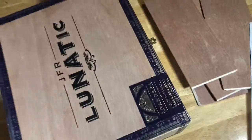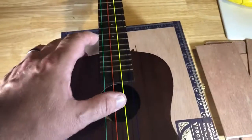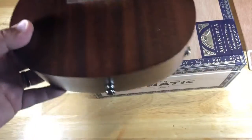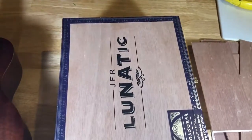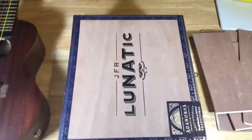With the ukulele, your distance from the edge of the nut to the 12th fret should be the same as the 12th fret to where the saddle is. So it'll be pretty easy to mark where that is — I'll be able to not only eyeball it but actually take measurements. That's this project and I'll make videos as I go along of the process.